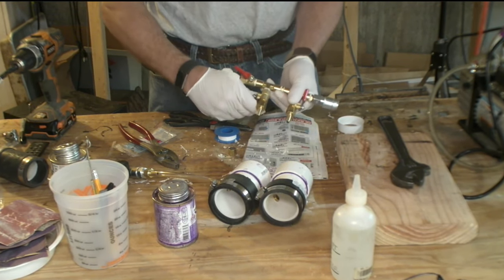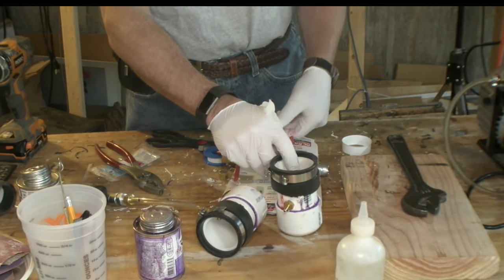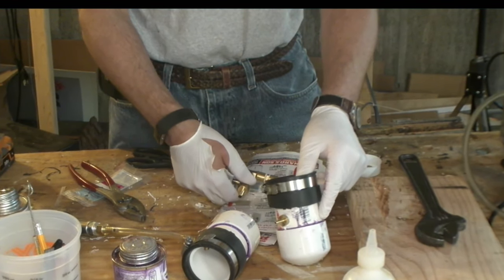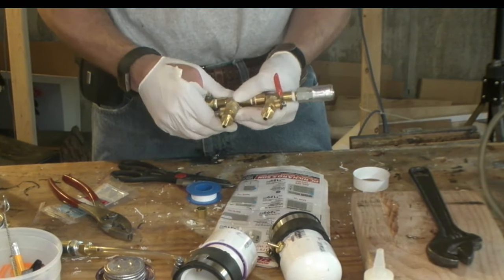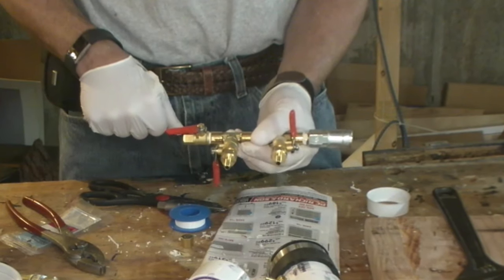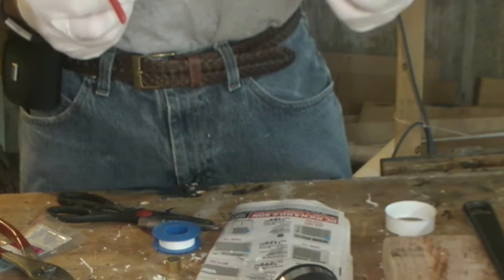You may be wondering — why three valves? When I'm using the sanding table, if I have one vacuum connected to a part and one not being used, if I don't have a way of sealing the unused port off I'll never get a full vacuum. So if I'm sanding against one vacuum port, I can close the other one off — just like that — and I'll maintain full vacuum. And when I'm done sanding and want to get the part off, I throw that third valve over, it bleeds the vacuum off, the vacuum heads release, and the part comes up without any force.